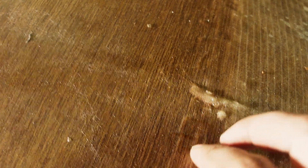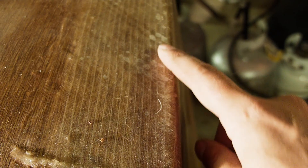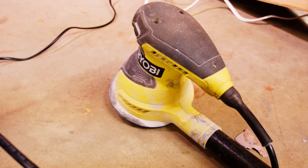This is the first project I ever did using fiberglass and epoxy, and if we look along the edge here we can see I did not do a stellar job. There's goopy stuff sticking up here, even worse over here. I put fiberglass tape on this edge and then fiberglassed over it, but I didn't do a good job of filling in the gaps before fiberglassing over it, so now I've got all of these air gaps. Fortunately there's a solution for fixing all these problems and it's called sanding.